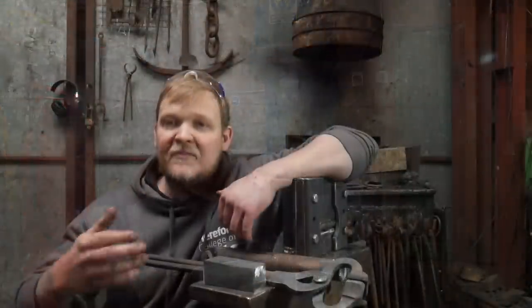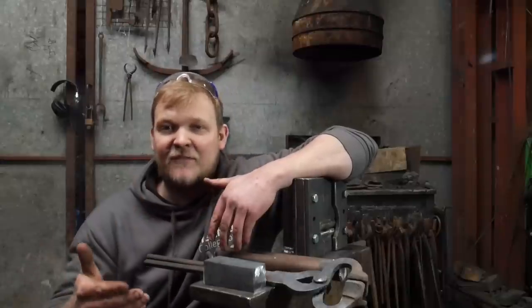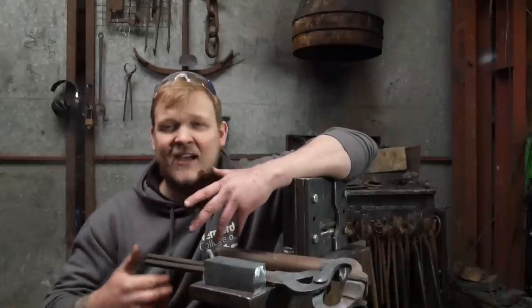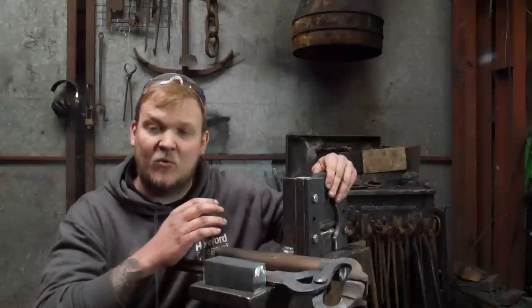That's fine. But after the point where the mass manufacturing becomes a little bit more fluid and you have to be putting a drift in and then running the fuller around the eyes and then doing something else, it kind of slows things down, it makes things more awkward. Also, this whacks really hard when it's under the power hammer. I didn't realise how much sensitivity I'm losing because I'm not holding the tool in.